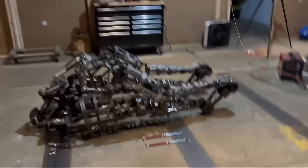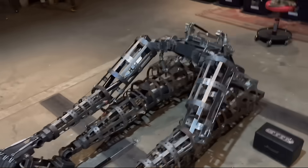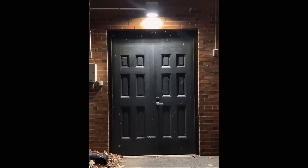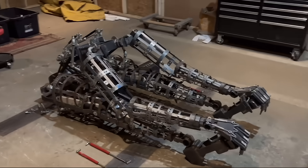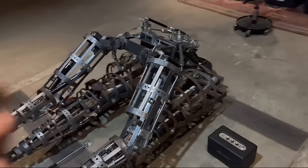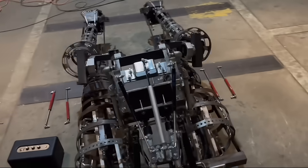Hopefully this has been informative to you and a decent timeline for some regarding just the next steps: standing Nosy upright, and what I'm going to be working on after the welding is done. The order of things to come — welding, electrical, hydraulic lines, and then those computer installations that need to happen after. Then there will be a rubber slash canvas protective layer around some of the cage designs in the limbs and torso, and on top of that a cosmetic fur outer layer that will cover the entirety of the animatronic. There will most likely be some other material on the palms and on the soles of Nosy, just so we're not hearing a clank every time it walks — quieter movement never hurt anybody.